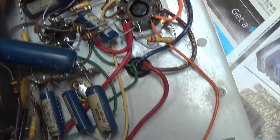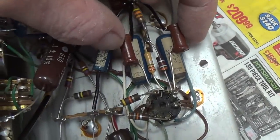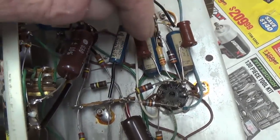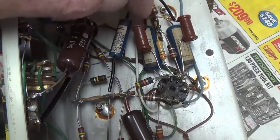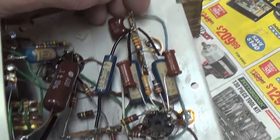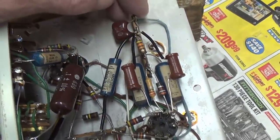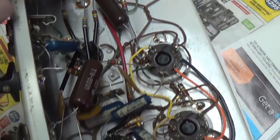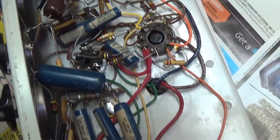I have to check for overheated resistors and things like that. I believe these are the two varistors — they look like the old-fashioned type of resistors with body-end dot markings. I have no experience with these Magnatone vibrato circuits, so this is new territory for me.